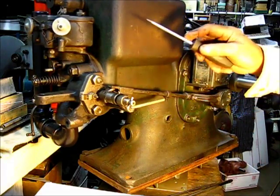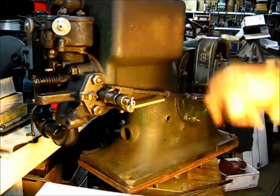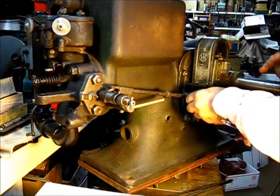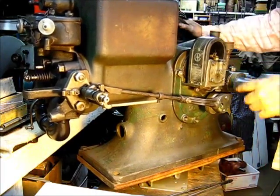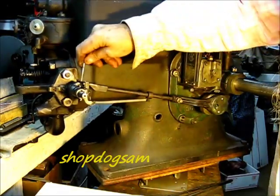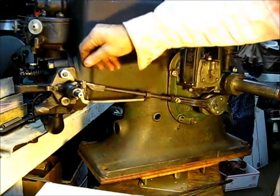This igniter — I don't think it was the one that was on this engine; I'm positive it's a different igniter. And I did have to remove those three shims that were behind that slide upper thing right there. The reasoning: when you rotate the flywheel all the way back on your cam throw, this gap between the slide upper thing and that tooth — when at rest — is supposed to be like 3/16ths. This one was more than a quarter of an inch, so I made that adjustment to set it right.